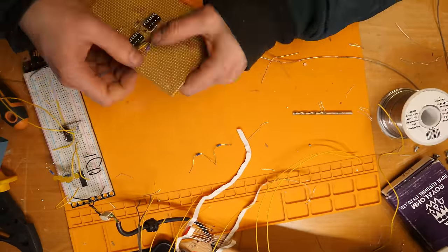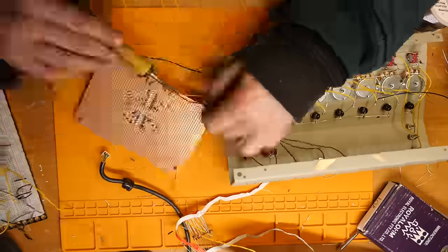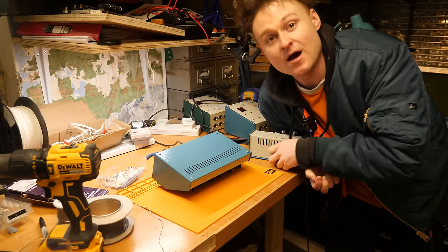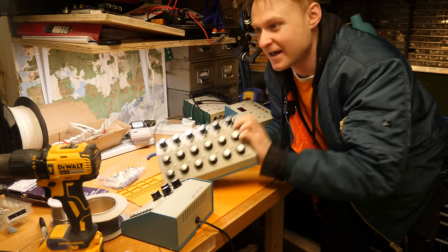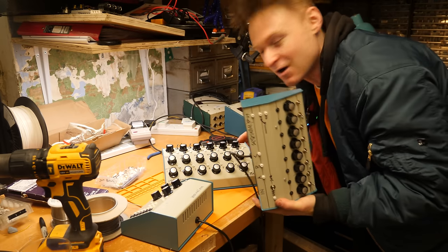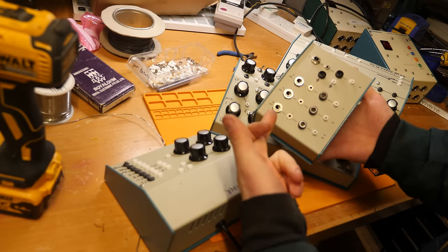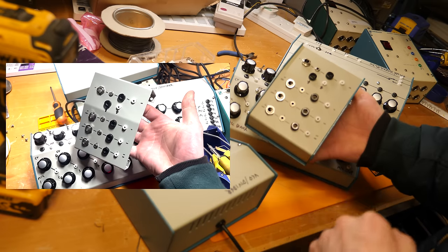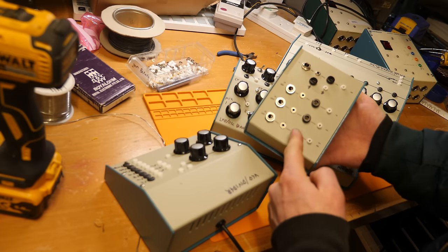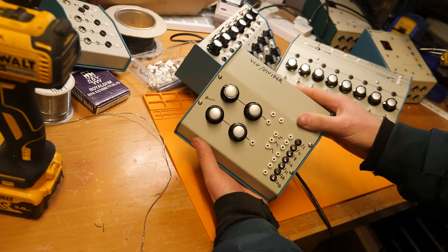This one in particular is just an oscillator built on a Curtis chip — basically an analog synth in a box. I also built a hex oscillator, which is six oscillators in a box. Then I built a sequencer based on a 4051 multiplexer chip. I wasn't sure how best to put these into the video, so I've uploaded full-length build progress videos over on Patreon. I've pretty much built a whole new synth. I got a little carried away and decided to build four cases. This first one is a simple converter — on the back there's literally just wires connecting jack formats together.